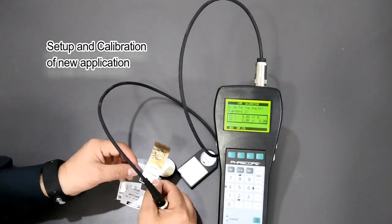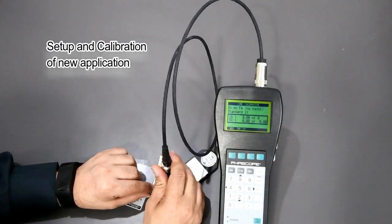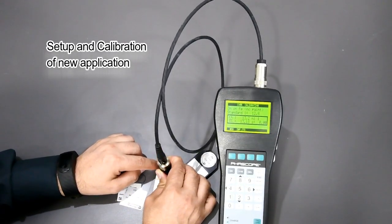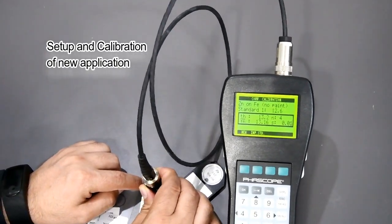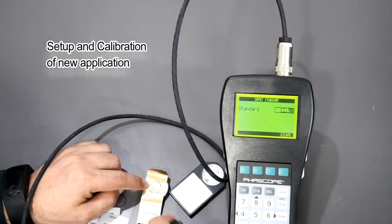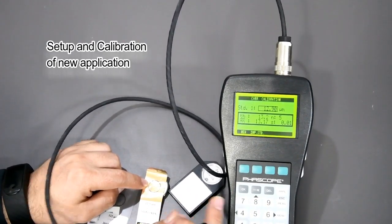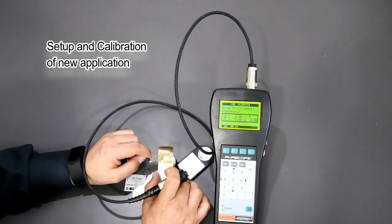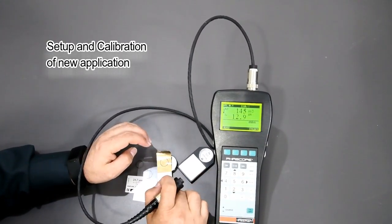Now after that, checking the paint foils, you can check the zinc foil. This is my copper film foil — you can consider it as such because the quantity of zinc and copper is comparatively the same. I will use it as a copper foil. I'll set the values here: this is 12.9 microns. Pressing OK. It's better if you have two foils for calibration, as the calibration curve will be much better. Right now I have only one foil for zinc.